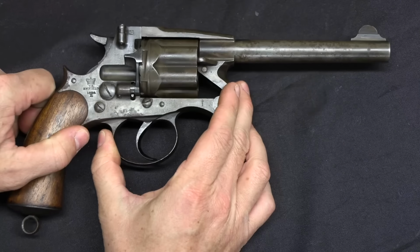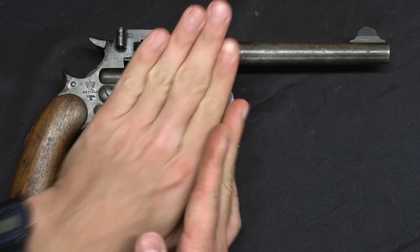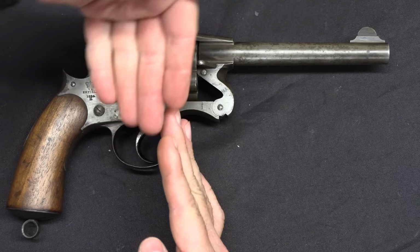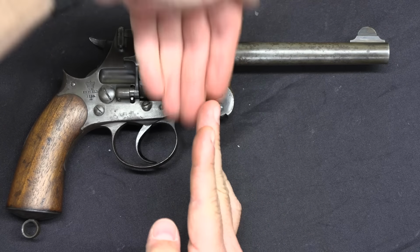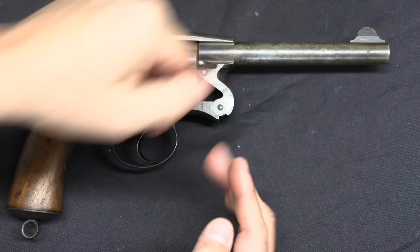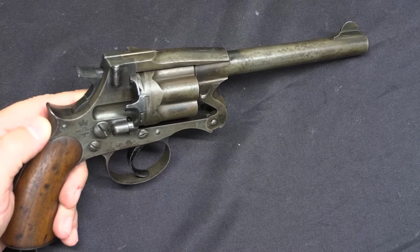The idea of a heeled bullet is that instead of having a cartridge case with a bullet sitting inside it, you now have a cartridge case where the bullet is the same diameter as the case itself, and there's a little step in the base of the bullet. So the case diameter and the bullet diameter are the same. That's as big as you can make the bullet and still allow it to fit into a chamber that's been machined to fit the case.